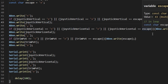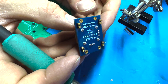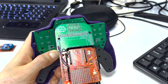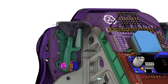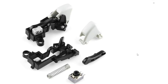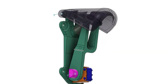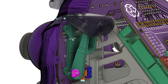There's also some code needed on the receiver side, but I'll go into more detail on specifics in the second part of this project. There are some obvious design flaws, like the joystick holes being the wrong size and it not fitting together quite as I'd like. Firstly, there's no reason for the XBee shield to be separate from my input shield — Sparkfun's XBee board is open source so I'm fairly confident I can just take their design and mine and combine them into one. Secondly, I want some triggers on the back of the controller. Sparkfun used to sell a PCB trigger but don't anymore, so I'd like to make my own version and integrate it. The trigger rotation is actually very small — maybe less than 20 degrees — so it's not a good idea to place a potentiometer directly at the center of rotation. I'll also need a spring to return the trigger to its neutral position, so there's lots to think about.